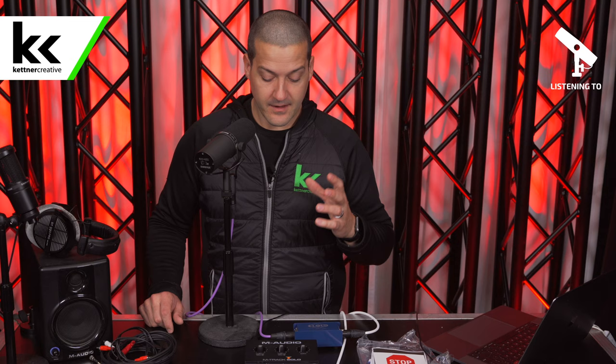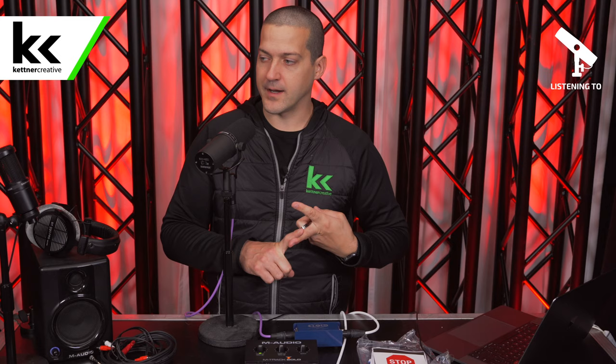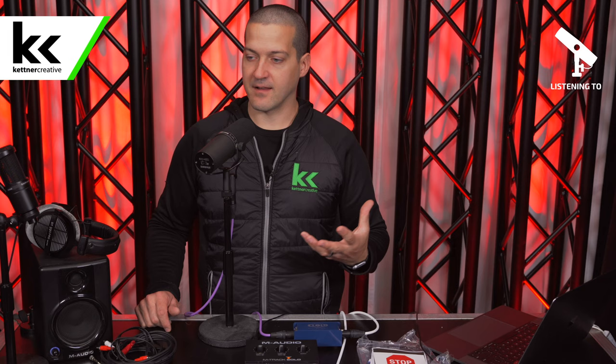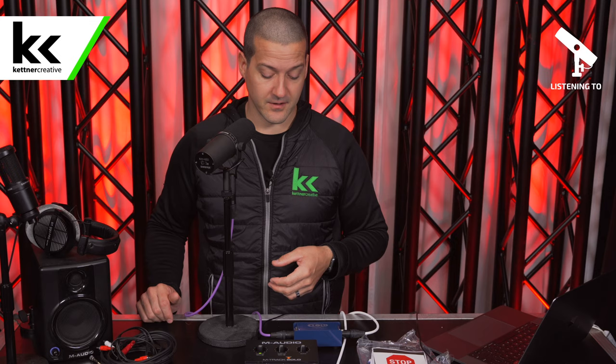I would say that if you are planning on running the Shure SM7B, the Rode PodMic, the EV RE20, or maybe even a Shure SM58, you might want to consider the Cloudlifter with this device. That said, the price of a Cloudlifter will pretty much knock you up into the next class of audio interface — you could get something like the Elgato Wave XLR, which has 75 dB of gain and would give you a much better signal with just a microphone.